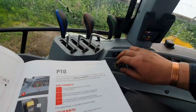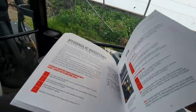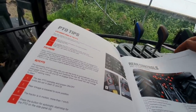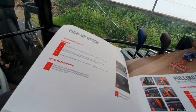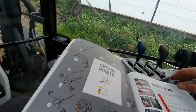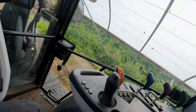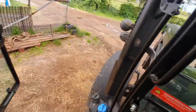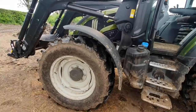Your PTO switch and PTO speeds are electronically selectable — three-speed PTO: 540, 540E, and 1000. You can set all your different engagement preferences: how hard you want it to set off, when you want it to come in and come out. It's very, very well spec'd, to be fair. Auto PTO, auto diff lock, auto four-wheel drive — we saw it on the previous video with that plow on, no weights on the front, and it handled very, very well considering the conditions were crap, let's be honest.